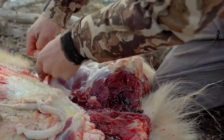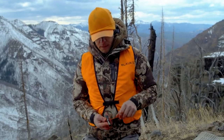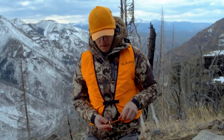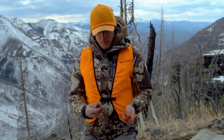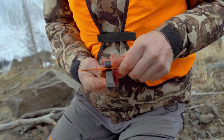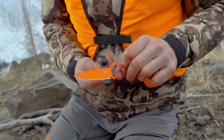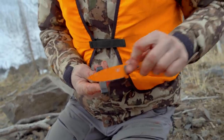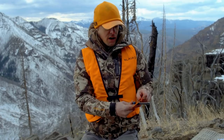Don't wait until it's just not cutting at all. Keep up on it. With the ceramic piece, I can hit my 20-degree angle here, then come over and strop it at the same angle. The angle guide guides me, and with the leather strop — there's my angle.